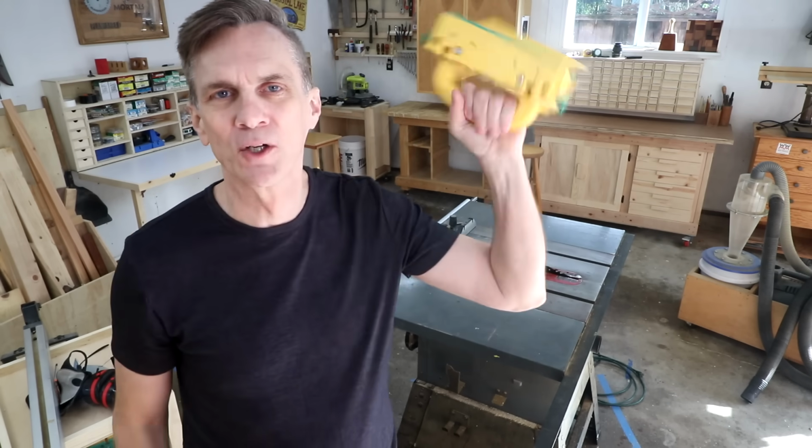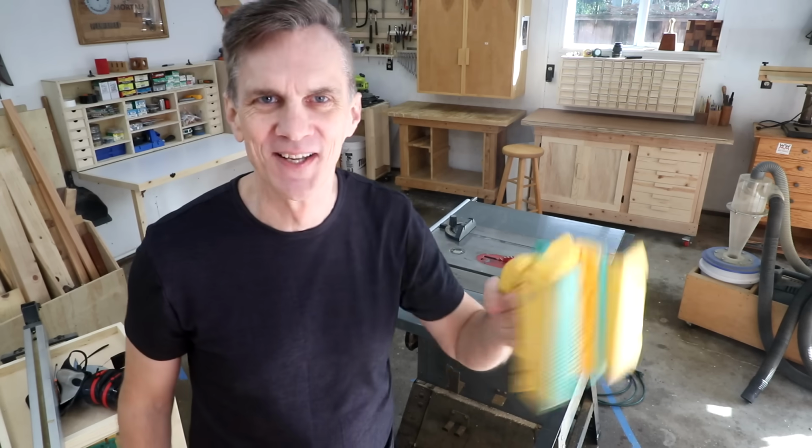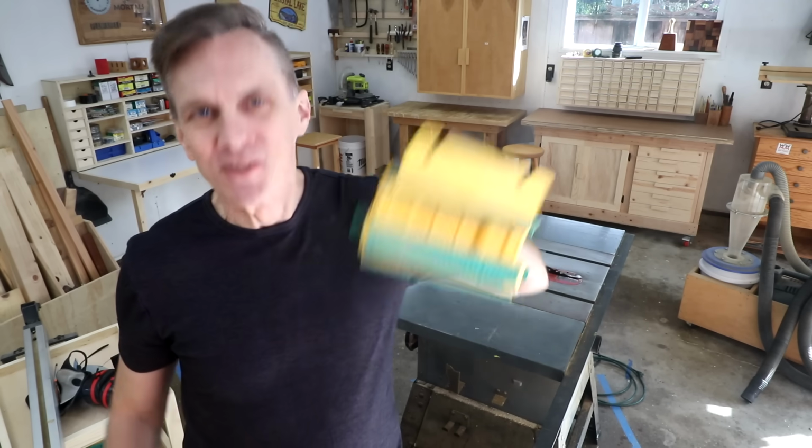I always use a gripper from Microjig. No, this isn't an ad, but I'll include a link for this down in the description. It fully supports the wood through the entire cut, giving me cleaner cuts, and it keeps my hands safe. A lot of people are more comfortable using push sticks, which is probably what your saw came with. Whatever you choose, don't ever use your fingers for the complete procedure.